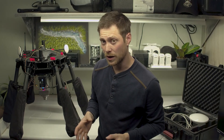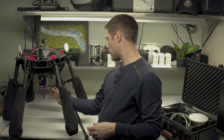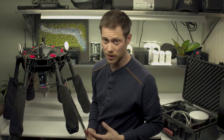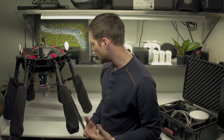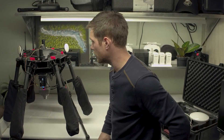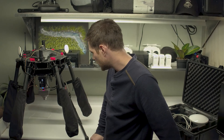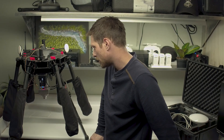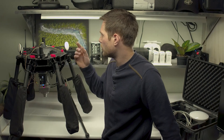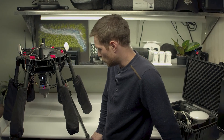One of the other awesome features of having an M600 paired with the LiAir V is the onboard camera used for photogrammetry. It has a micro HDMI cable and you can plug right into the side of that. It's really nice to be able to monitor the photos being taken as you're flying to avoid over- or under-exposure. That's all you need for setup. This usually takes about three to four minutes for calibration. The only times I've had trouble with it is in treed areas where it was having difficulty getting a GPS signal — just move it and it's fine.